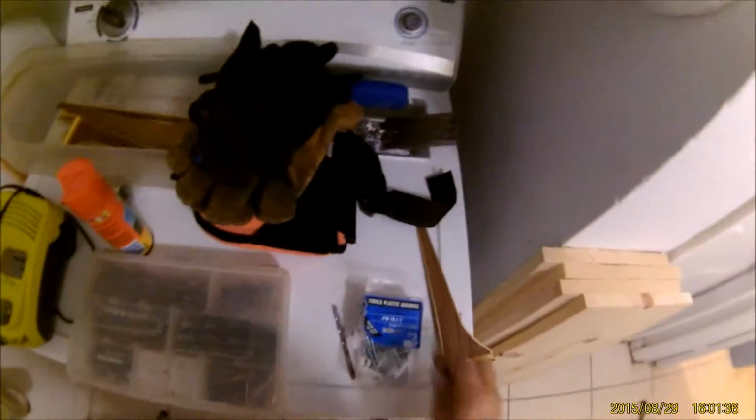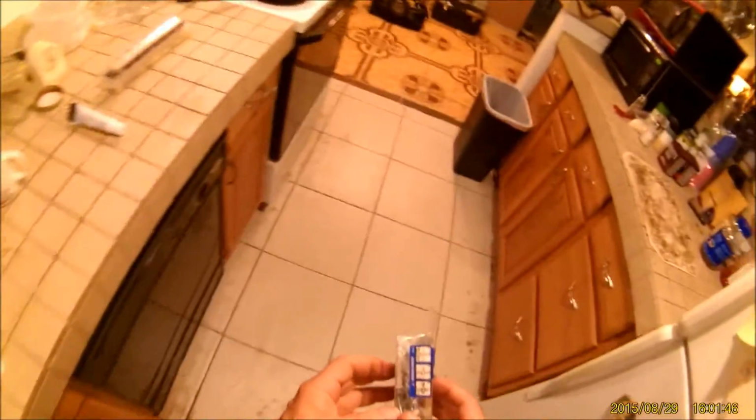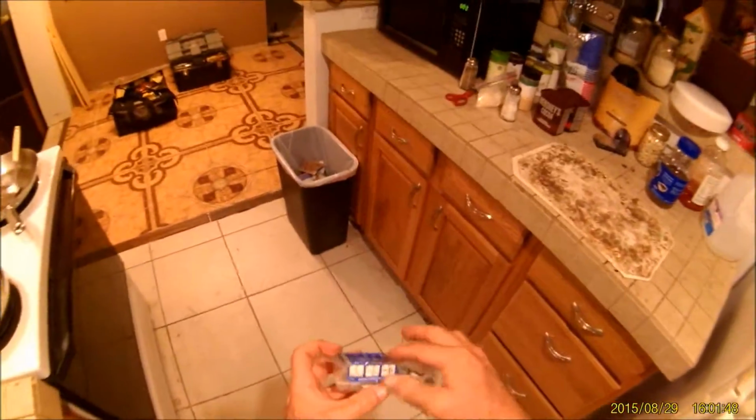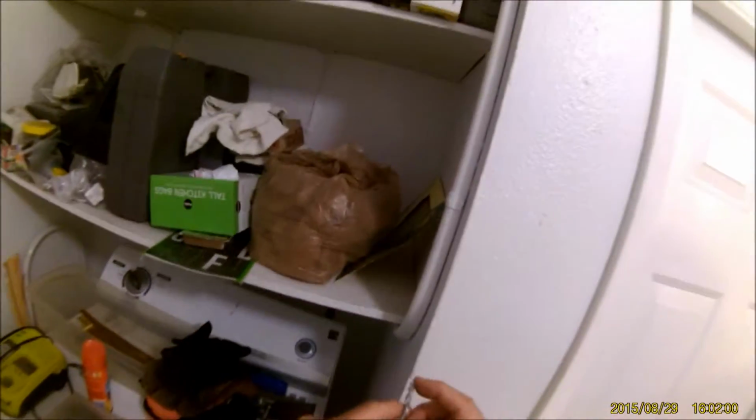Now, next question is what size drill? Well, you have to look at this and see what size drills these guys want right here. This says a number 8 by 10, and it should tell me exactly what size drill. It uses 3/16, and I think we went over and exercised that last time. I think a 3/16 might be sitting out here. I don't know if it's 3/16 or not. This looks like a concrete bit. No, it's not.